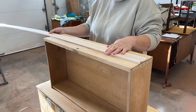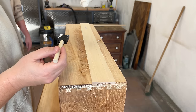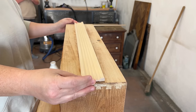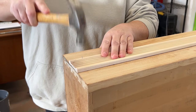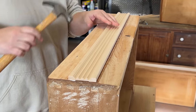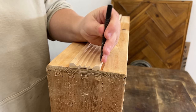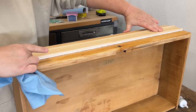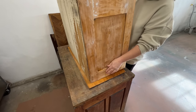Now I'm ready to work on the new trim for these drawers. I marked off how long I needed each piece to be just by holding it over the drawer front, then cut it down with my miter saw and used a little bit of wood glue — which was really cold from being out in the garage, so I had to spread it out with a foam brush — and tacked everything down with some little finishing nails. I used my nail set to punch those nail heads down just under the surface of the wood, filled in those holes with some more wood filler, and then added just the tiniest bit of paintable caulking along the edges of all three strips to make them look more seamless. I decided now was a good time to reattach the top upside down to avoid all of the damage on the other side.